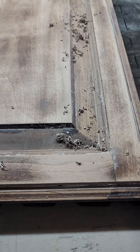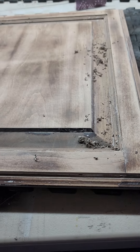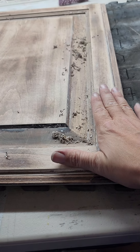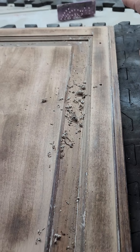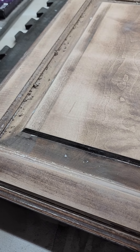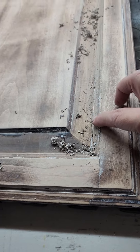This laundry room was done with bare wall paint and unfortunately it was gummed up and gloopy. It was already starting to fail because wall paint is not cabinet paint. You're constantly touching your cabinets all the time, especially around the knobs and pulls, and it ends up deteriorating the paint over time. Especially in the laundry room, soaps and things hit the cabinets, and if you don't have a quality paint on there it's going to cause failure.